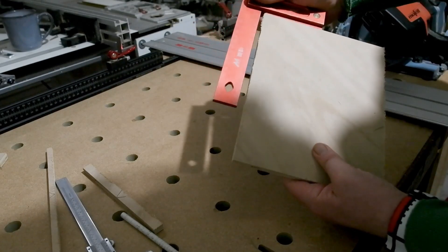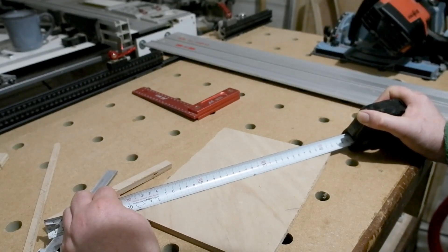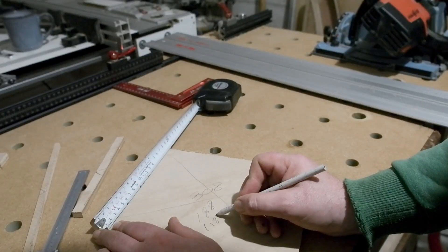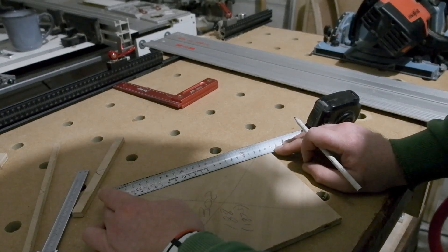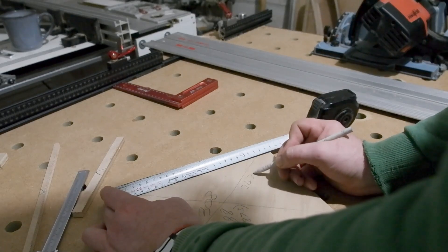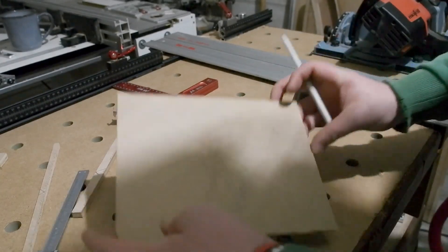I did this exercise three times and was never more than 0.04mm out — so stoked about that. As a double-triple check I measured the diagonals of the board which came out at approximately 308mm, then the same for length and width — 188mm or 187.5mm. Those who know the maths will know that's within a hair of dead square, especially with room for discrepancy when hand measuring.